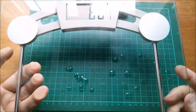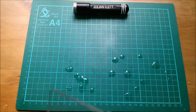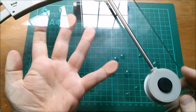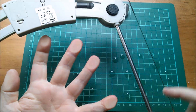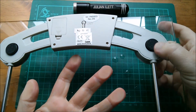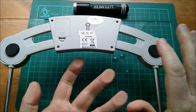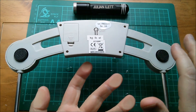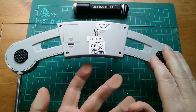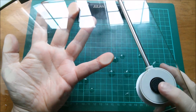The third thing was this bathroom weighing scales. You tap it to power it on. It's quite a minimalist design — really just a piece of glass with this plastic assembly on it. I'm assuming these pipes are there because there are wires running down here, and this thing actually has four pressure sensors — force transducers — because force equals mass times acceleration.